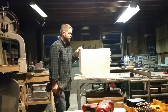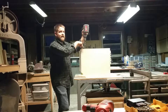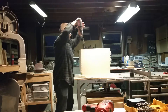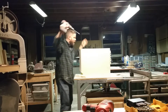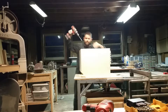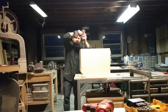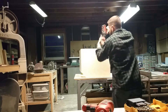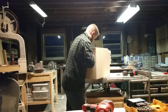We have our half-inch chuck and 15/32 inch drill bit with pilot holes drilled. To avoid tearout, I start on the top and drill just enough to put a hole through the Formica — I don't want to go all the way through. I put it on the lower speed setting. One, two, three, and four. Then I go down just about a sixteenth of an inch more to make sure I've got a hole into the top of the wood. The key is to take your time and not drill all the way through — that's how you get blowout.